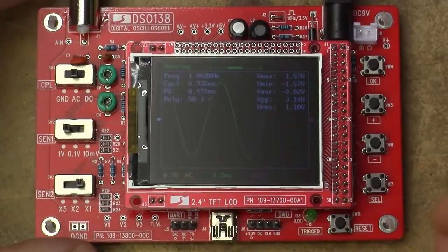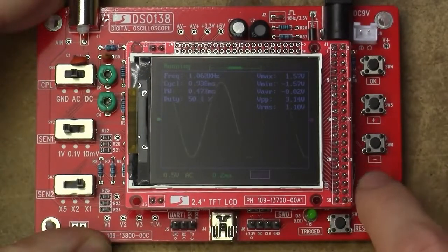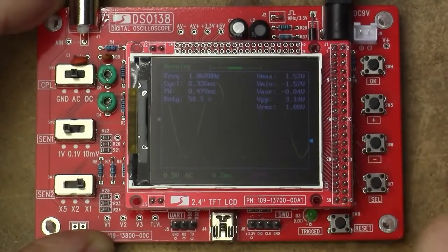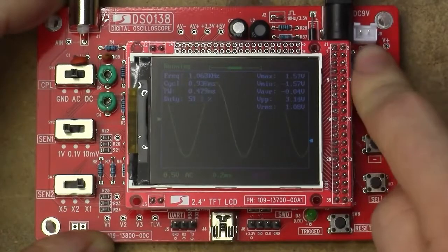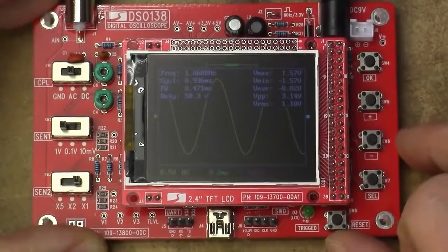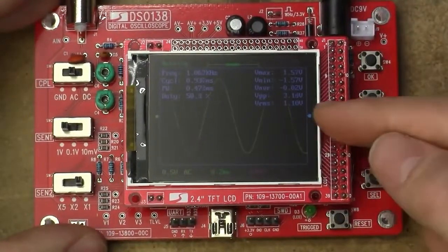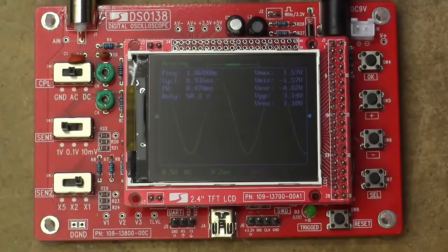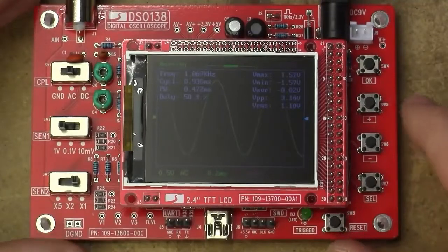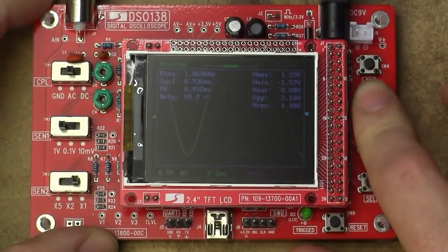So does the trigger level thing work now, or is it still going to be broken? Was it just broken because we were at a fast time base? Right, moving it off to the side. Hey, it works now. So in order to make the trigger level auto-centering work, you need to perform a V plus adjustment first. Fair enough, you should always do the calibration in order to have the thing in spec anyway, so that's not as bad as I initially thought.